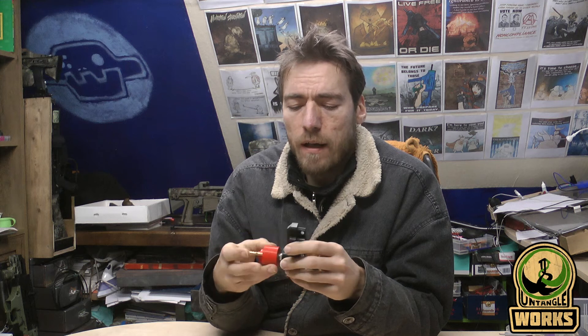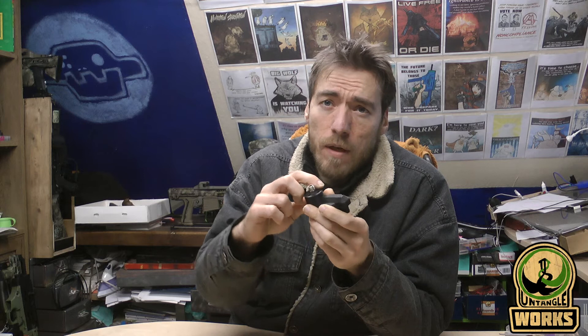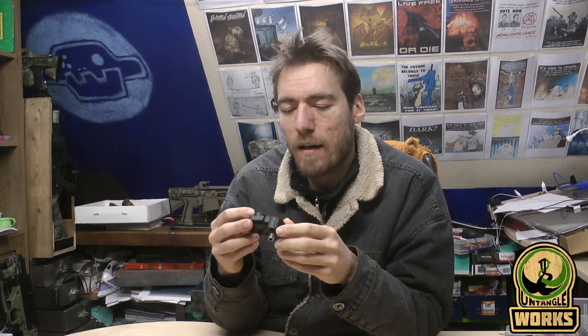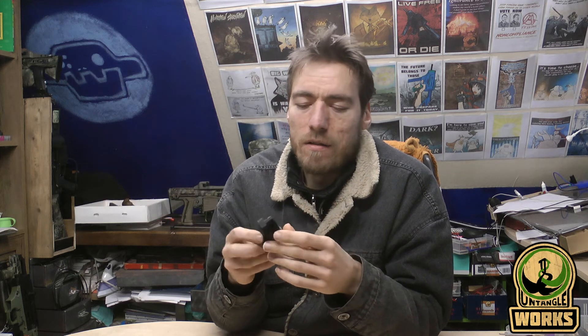If you really want to make it airtight and have to use a 3D printed part, I would suggest putting JB Weld even around the threads you insert, so those are also closed and the compressed air cannot get contact with the outside. But if you're going to do something like that, why not just use a normal nut, apply some JB Weld, and glue it inside a 3D printed plastic mold to hold it in place? It starts to lose its purpose.